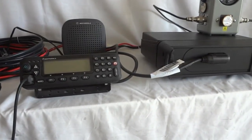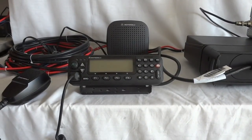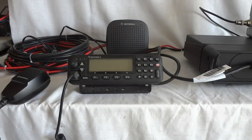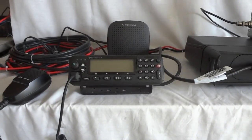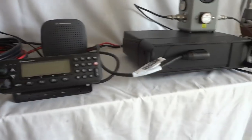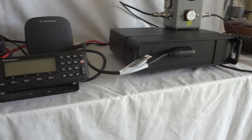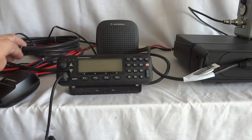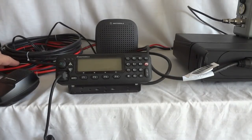What we see here is the Motorola MiCom HF radio developed by MoBat, which is Motorola and Bartel in Israel, marketed in the United States and also used a lot here. This particular one is a trunk-mounted version with a standalone control head. This is the radio module — it is very rugged, all die-cast metal construction. The control head is connected with a 17-foot control cable, and we also have a power cord that is about 20 feet long. The power cord has two fuses.